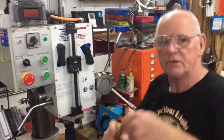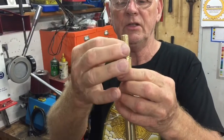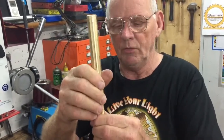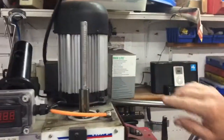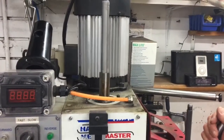He machined the brass and threaded it, then cut the rest of the thread as a pilot into the old hole, so that would give it more of a spigot affair. That's done the same thing here, and now it turns around with the quill.